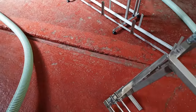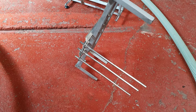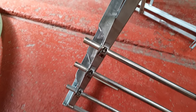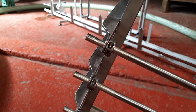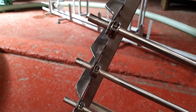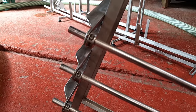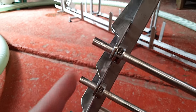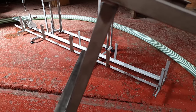This here is the fill rail, as you'll be familiar with, with the fill tubes on there. We've anchored the fill tubes — which is a new addition — by welding these collars on, and that's allowed me to insert the fill tubes and prevent them from moving up and down. They've also been welded on one side so they still function.